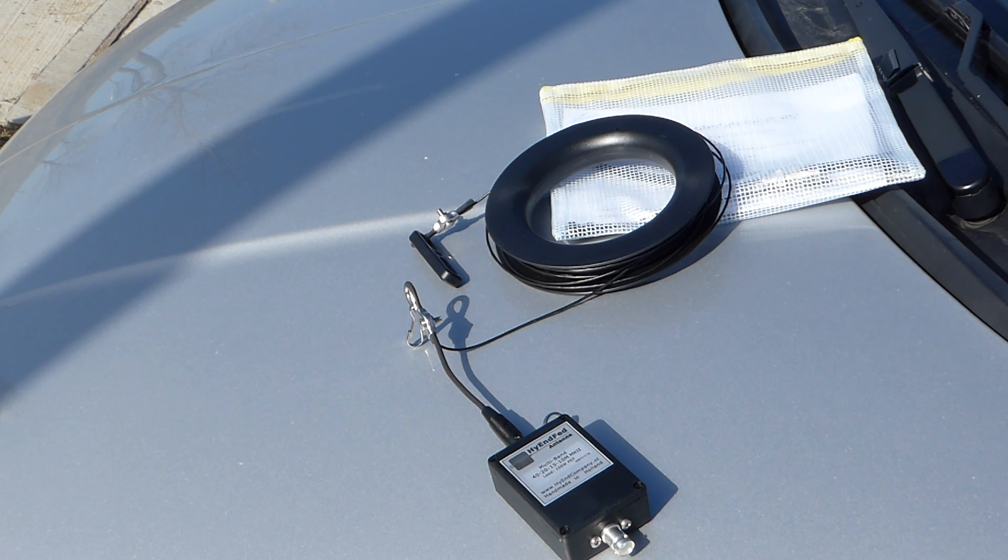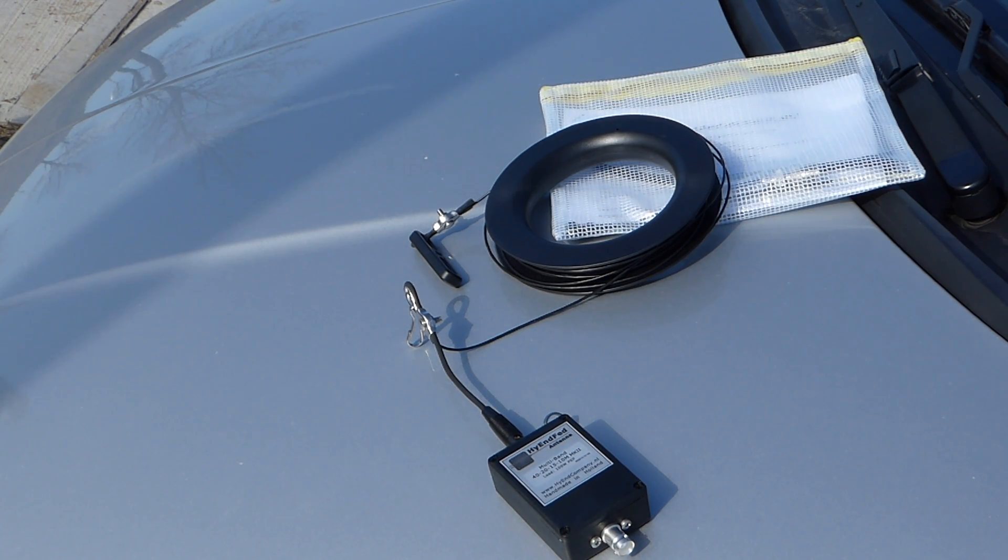Let's take a close look at the Ultralight Mark II Packet. Like other high-end antennas, the Ultralight Mark II Packet is an end-fed design, meaning that if you install it as a sloper, you only need one support point, preferably up high and in the clear. I should also note that this antenna would also work well if mounted in a horizontal configuration, though the radiation pattern will be quite different from that of a sloper orientation.